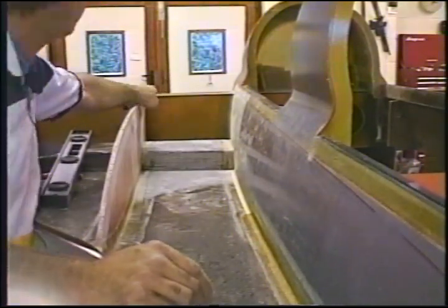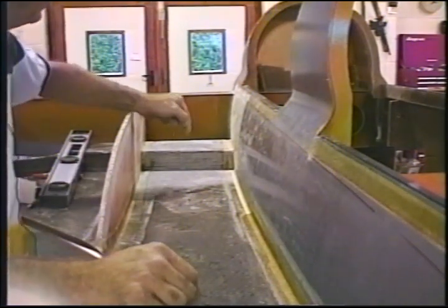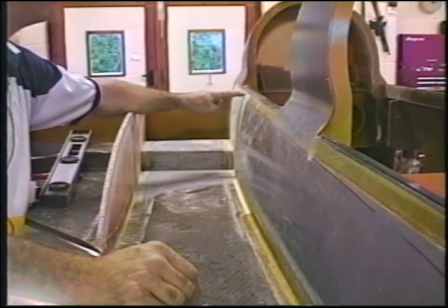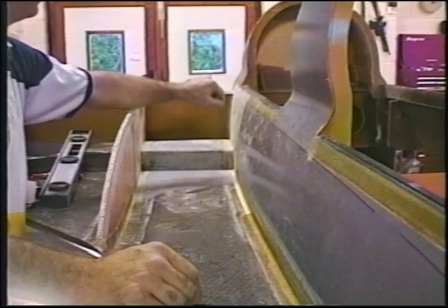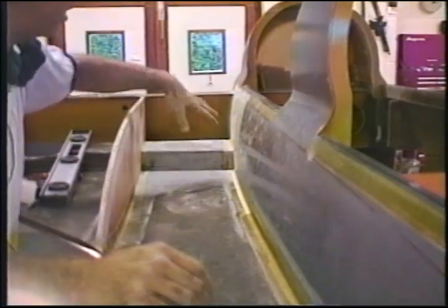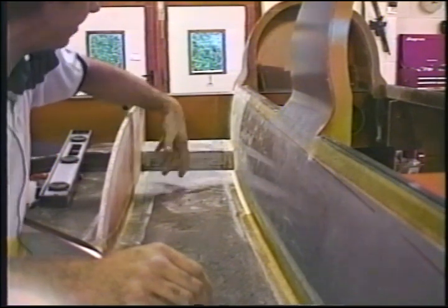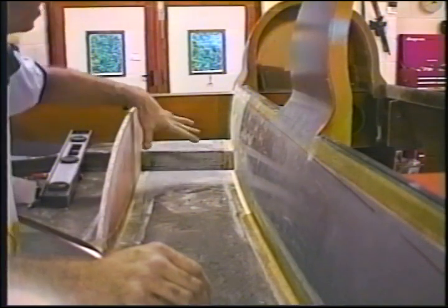Your first ply is going to go from this intersection back here to this intersection, and then they're going to taper back 1 inch per ply. You'll end up with a full 7 plies on this face, and 3 of those plies will go all the way up to the bottom side of your canopy frame that sticks down 3/10 of an inch. And the reason you're sanding this whole area is that before you do the 7-ply layup, you can put your veil in on the bottom, your 2-ounce cloth that covers up the bottom of these surfaces, so you have a completely sealed bottom.